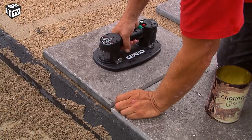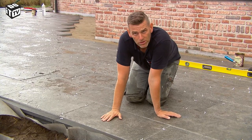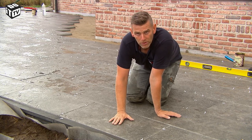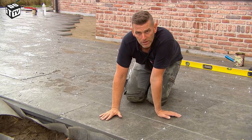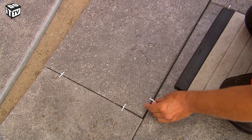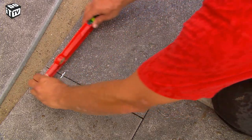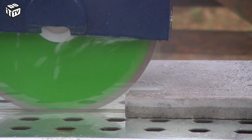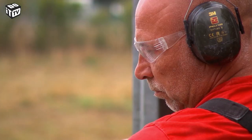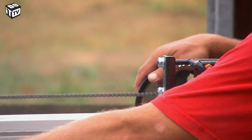Once a number of rows are laid, you can start placing tiles on the leveled stabilizer from the rows. The tiles consist of natural granulate and color differences occur in nature. The manufacturer adds pigments to cover this up, but we recommend mixing all the pallets that are delivered so you get one uniform whole. At the end of the terrace, tiles need to be custom-made to fit perfectly — the saw table serves well here. Also think about your safety: wear glasses, hearing protection, and gloves, and definitely consult the manual.